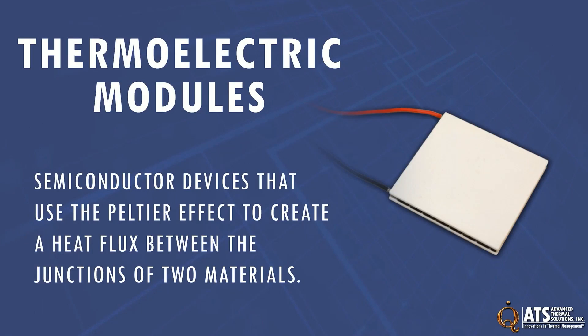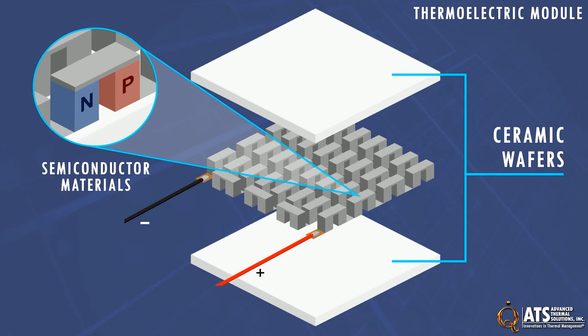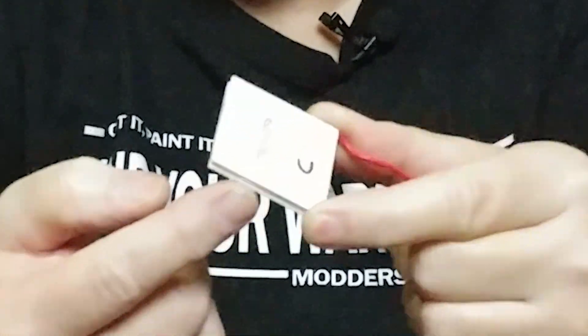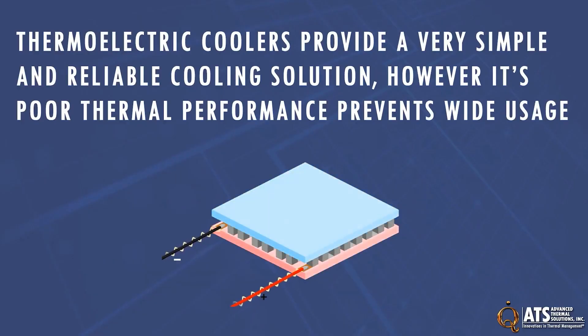That still doesn't make much sense, right? So what they do is they take two unique semiconductors — one is a type N and one is a type P — and they have different electron densities in them. When you alternate the P and the N and put them together in a series — here it is right here — the semiconductors are in the middle, and then you have a ceramic plate on the top and a ceramic plate on the bottom. There is actually what's called a hot side and a cold side; that's why mine is tagged C and H.